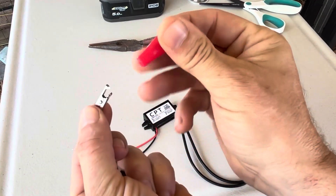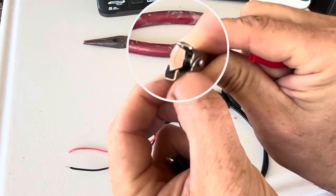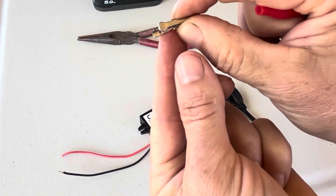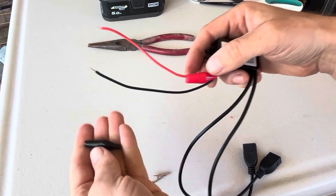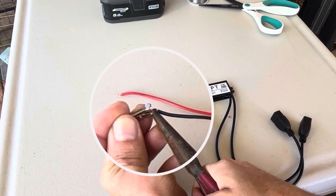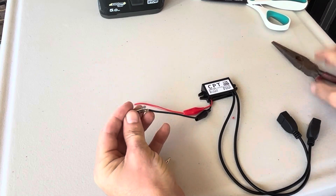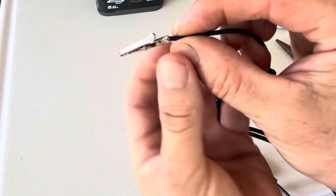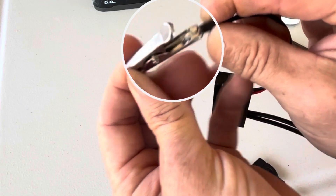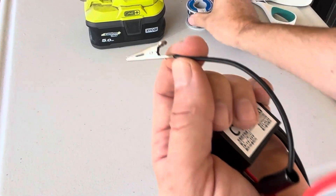Simply slide the little cover off. As you can see, there are two little metal tabs — that's what you're going to put your wire in, then basically pinch these tabs in to hold the wire. Make sure you slide on the covers first. As you can see, those little tabs have clamped down on the wire — a reasonably good connection. I'm going to solder this as well, which is an optional thing you can do to make it a little bit stronger.